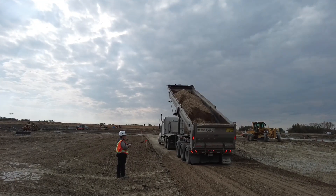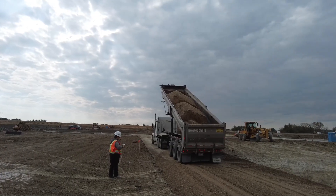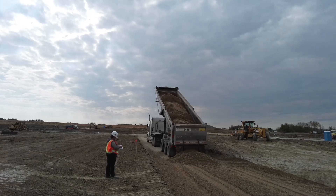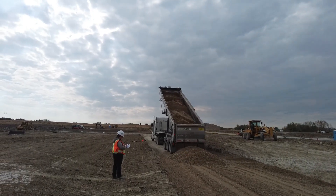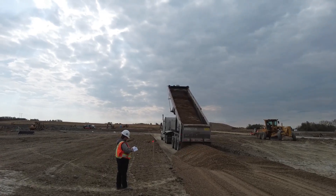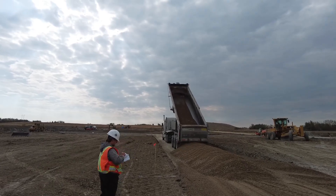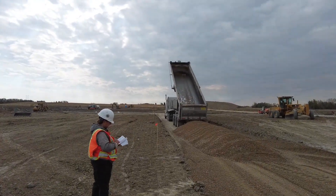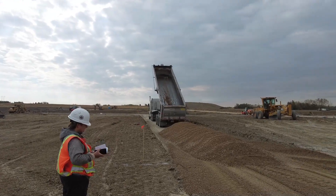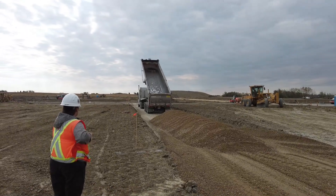This procedure works really well, and the only alternative is to either guess the 200 millimeters of gravel, or else have a grade crew check it after each dump. Over the years I have tried guessing the quantity with the grader, and it works okay, but I might guess 180 millimeters in one spot and maybe 220 at the next spot. This procedure works a lot better.